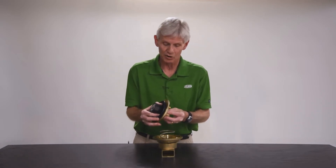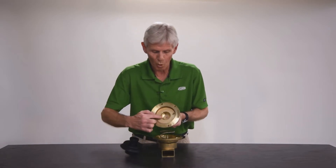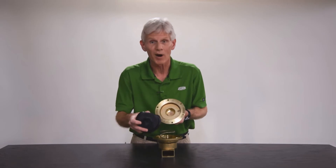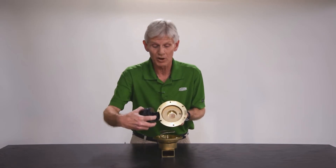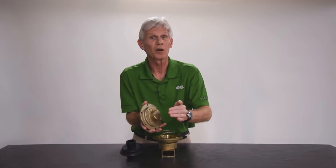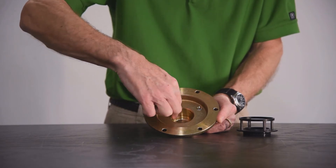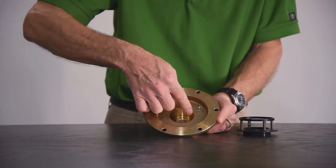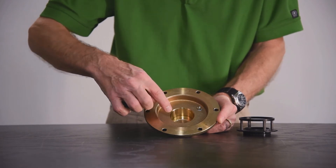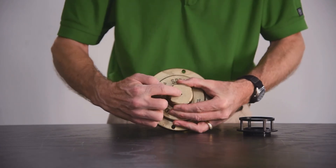The first area to look at is within the relief valve cover. This bore internally has a very smooth surface, and we have a plunger that rides in there with an o-ring on that plunger. That o-ring seals off atmosphere inside that area. If we get a lot of pitting or a lot of green patina growth — that green coating you get on copper alloys — it will cause that o-ring to leak and you'll have weephole leakage, with water actually coming out of that weephole.